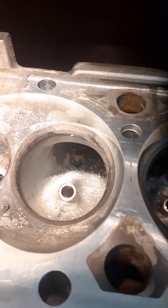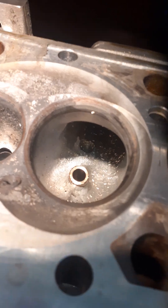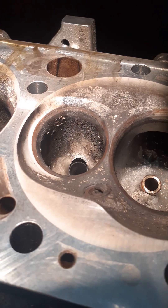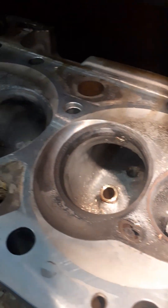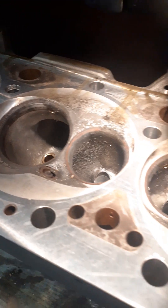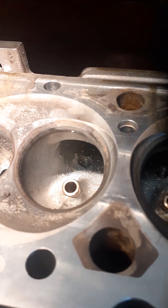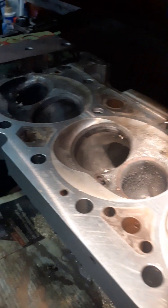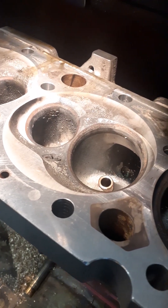That will take care of a very long valve guide life, valve life, and also power, because the valve will not have to find its way onto the seat - it's guided with as little play as possible. I don't replace valve guides the normal way because it takes more time, but you want to deliver quality and long-lasting quality so the customer will enjoy a head with a long service life and as much power as possible. It's also a business card running around on the circuit.